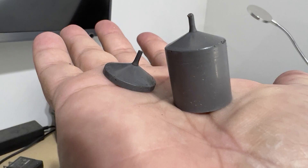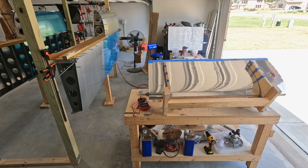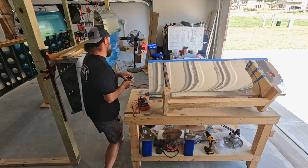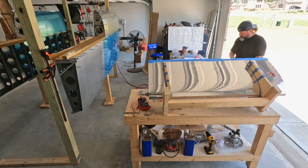The usual morning cleanup commences. This is the leftover sealant from doing the end ribs. The first set I did, I mixed an ounce and a half of sealant — you saw a lot of leftover in that syringe. The other one was one ounce and it was barely enough. So maybe one and a quarter will make you feel good about doing it, at least if you're doing the tanks the way that I am.